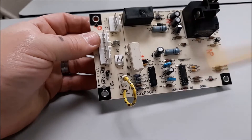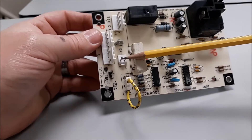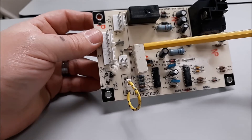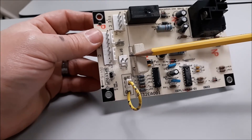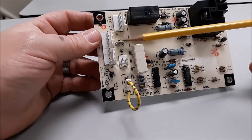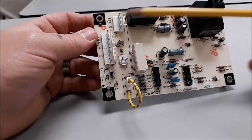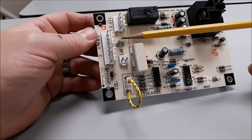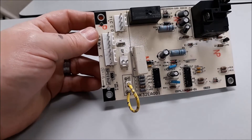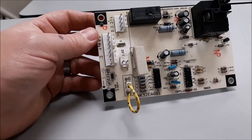The third plug is right here — that's where our defrost sensor plugs in. You'll see it labeled DFT. You'll have two pink wires on a molex plug that plug into that. And this Y terminal is where Y goes in, and Y basically comes straight back out. As we go through the summer months, you're definitely going to need to remember that.